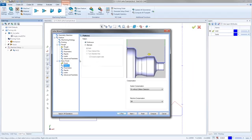Now for the finish pass on this, I'm going to go ahead and do an alternate finish, and I want to go both ways. So with the alternate option, the problem that I have with the continuous is if we start right here, as soon as we start getting into these walls where we got to work up, you got that big mess building up in front of your tool right there. Same thing with right here. You get into these corners, you just got this rat's nest building up if it's not breaking the chips right, and it just gives you a more marred up, bad finish.